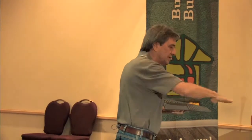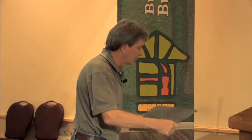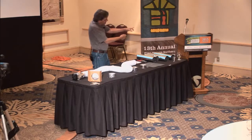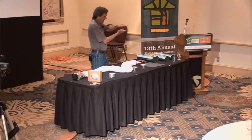Now, if you're going to put wood slats for this, you have to do one of two things. You have to use pressure-treated wood or a little bit of plastic. And when I say plastic, I'm talking simple. It could be garbage bags. It could be shopping bags. Just a piece of plastic between the wood and the concrete. So if it's white wood, it's not protected, all that is what we call a capillary break. The moisture can't go from the concrete to the wood.